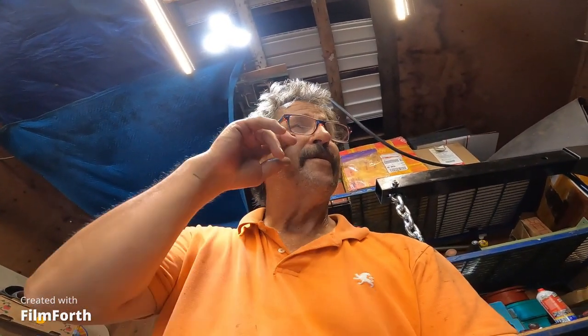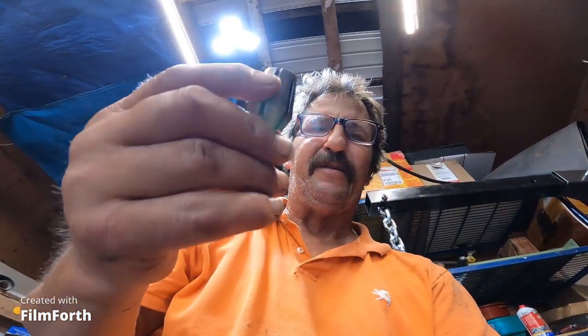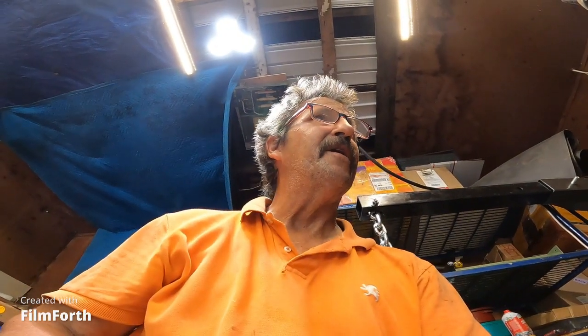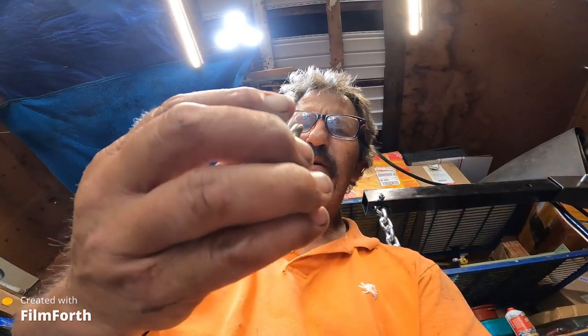So you saw me turning that threaded rod, trying to make a 1/4 inch end. And this 1/4 inch collet doesn't want to behave properly. I redid the diameter, had it at 250 exactly. Wouldn't quite slip on. I'd shaved just a little bit off. It was too much. I did it again. But I couldn't get this to tighten up on the tool. Now here's a 1/4 inch tool here, and well, I haven't tried it, so I don't know.